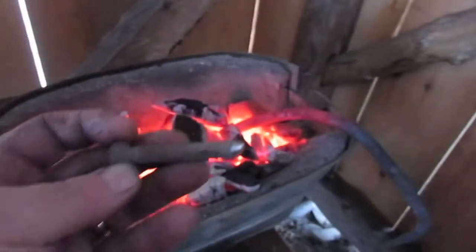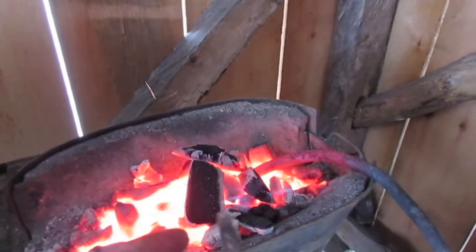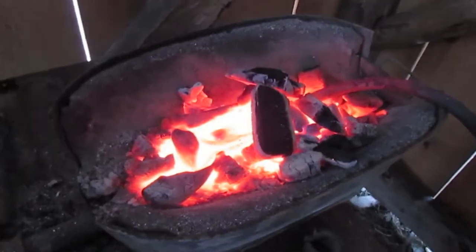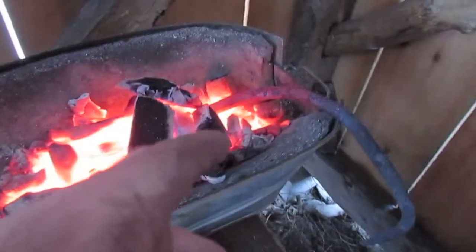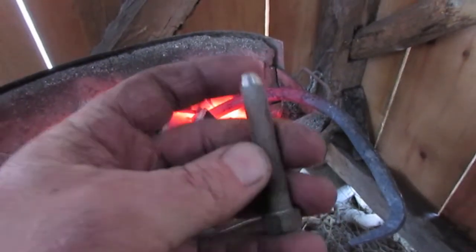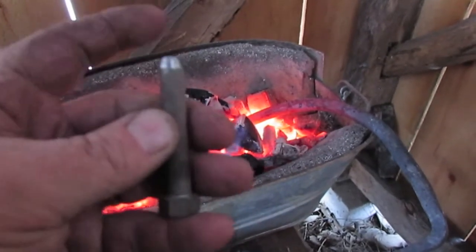I have chopped off this little bolt and sort of shaped the end very coarsely. I have drifted those holes — I drilled a hole and then I drifted it cold, drifted it open on the hinge band. And then I did show you the one on the eye of the hook. So I'm hoping I can drift this through cold — this mild steel bolt, it's a piece of scrap. And then I'll heat the whole thing up and rivet this down, I hope.